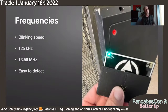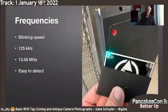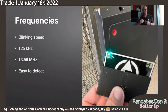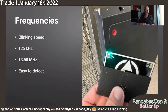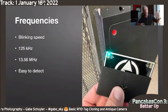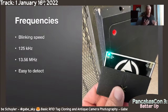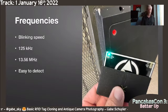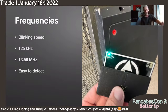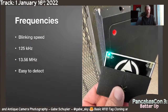Your RFID tags operate at a certain frequency — that's the speed the lighthouse is spinning at. The two most common for access technologies are 125 kilohertz and 13.56 megahertz. You'll want to do some research to figure out which yours is. If you want to look cool, there are easy ways to detect which frequency is in use, since the reader is the flashlight sending out energy. What I'm showing here is a card with an LED that can pick up that energy and channel it into an LED. This is the reader on my garage door and I'm holding up something the same format as a credit card — it's telling me this one uses low frequency. Super easy to figure out on your own, and you kind of feel like a spy.